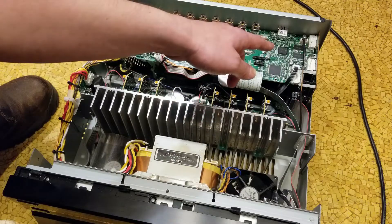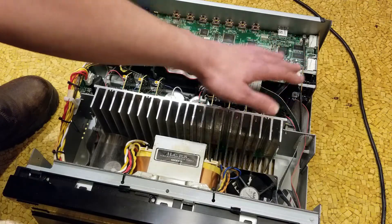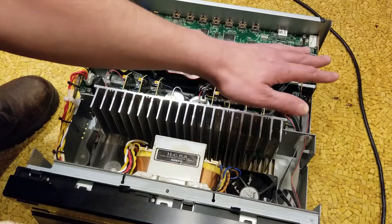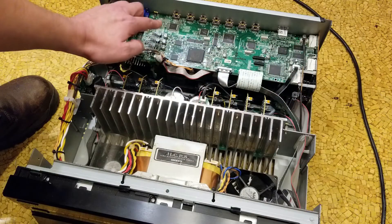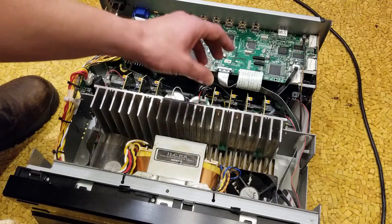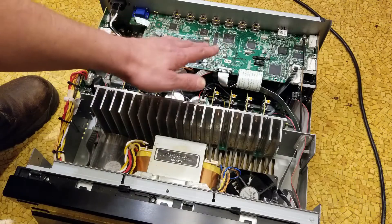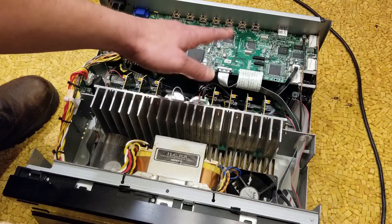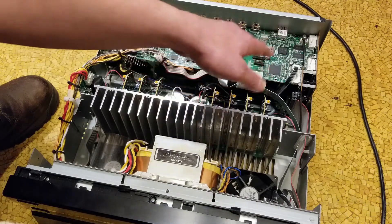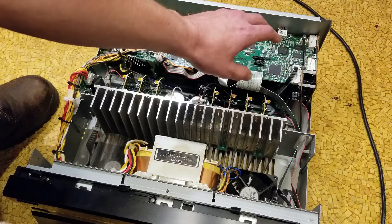I'm going to see if that's the issue — it exhibits the symptoms, so I'll apply just a little bit of heat. For anybody watching these videos about trying to fix the Onkyo DTS chips: using halogen bulbs and hair dryers could more or less work, but you don't have any way of telling how hot the chip is. These chips are run through ovens during manufacture — the solder melts at between 190 and 215 degrees Celsius, or 375 to 400 degrees Fahrenheit. So first I'm going to try heating up this chip, doing a reset, and seeing if that seems to be the root of the issue.